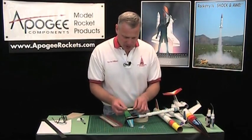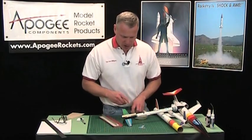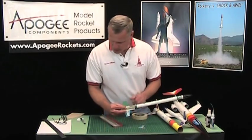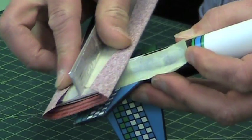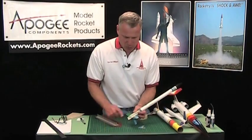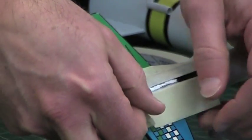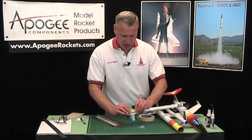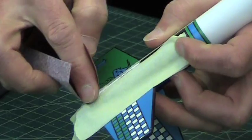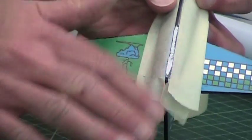So I'm going to take tape and mask off the perimeter of where the fin used to be. Then I can take my sandpaper and sand down within the tape. The purpose of the tape is to help protect the other areas. If you sand through the tape, just lay another piece right on top. You want to protect that paint because you obviously don't want to have to paint again - that's what we're trying to minimize. You can also just take the sandpaper in your hand and get real close in there, trying not to get down into the fibers of the paper.